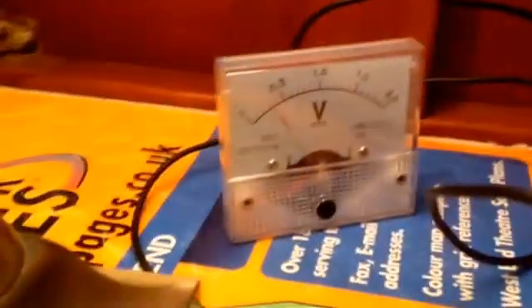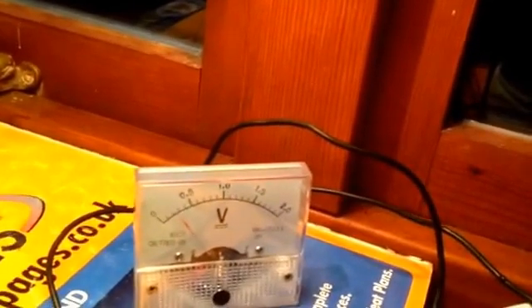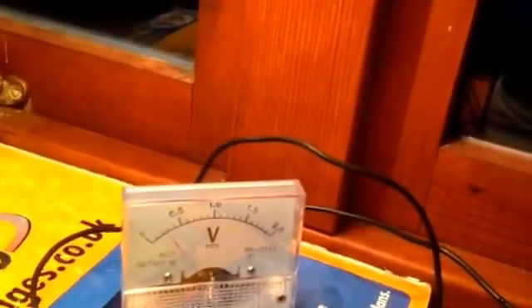I also had a play with stray voltages to see how easily you could detect them going through the boat. Our semi-protected bolt is reading 0.5 of a volt. Then introducing a 1.5 DC volt leak current, you can immediately see all that protection can be gone. Bear in mind there are no 1.5-volt supplies on a boat — they're all 12 volt or above. I was also considering testing the earth current from the mains to see what voltage that gives — maybe in a later video.